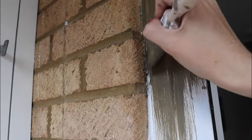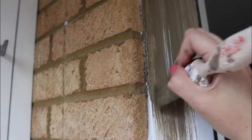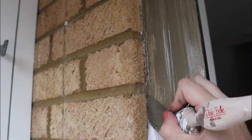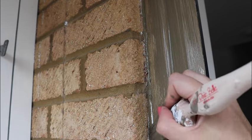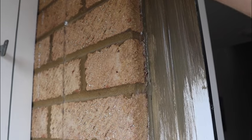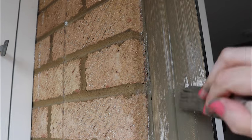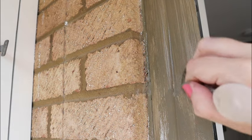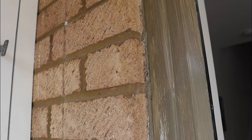I've got a white frame all around the outside, so there's a good chance you'd want to paint the frame of your door as well, unless you want it to contrast with the new color. This is where I've got some interesting caulking up the brickwork, and I had the choice of painting a smooth line but having the white caulk stand out, or painting over the caulk as well for it all to blend in. Fortunately the color I was painting was not too dissimilar to the mortar between the brickwork, so it blended in relatively well.